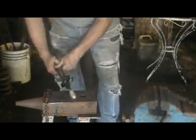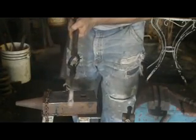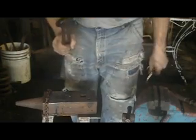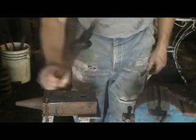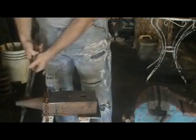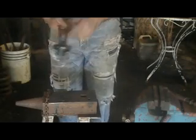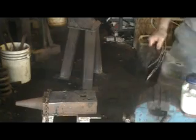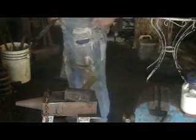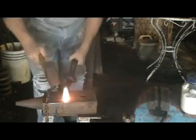Punched with a round punch. And I have a nice hole in my bar stock, which could be used for any number of things that you want to make. Simple, effective. And what's left over is called the biscuit. Many a biscuit has been the bane of a barefoot boy, is how the little ditty goes. They would fall on the floor in the blacksmith shop, and some kid barefooted would go and step on it. Wouldn't be a good thing for their day.